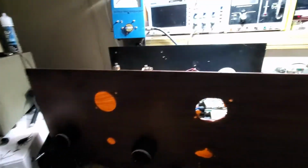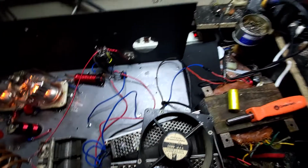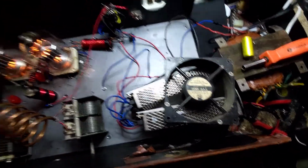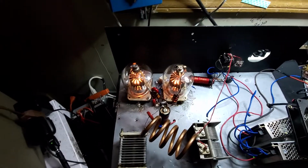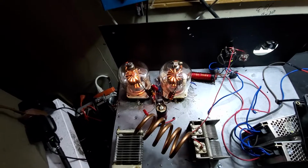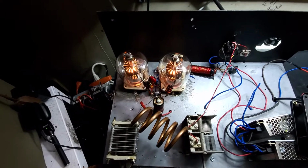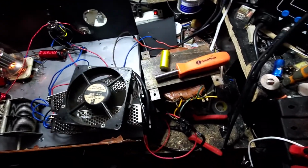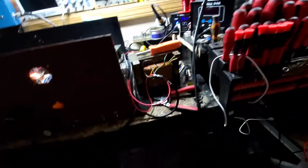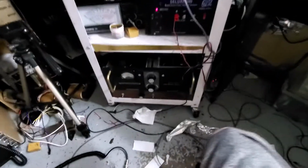So, this is our new Birdcage 1000 triode platform. It does have to be driven. DC filaments. Zero bias. There's no biasing going on here at all. None. Zero. Because of the DC filaments, it has eliminated tons of oscillation properties that we've gotten rid of. And there's some parasitic suppression going on the bottom as well. So there it is. Still slightly in pieces, not lettered, not complete, but nonetheless, its heart is beating. And it is kicking ass. Just like mine kicks ass.